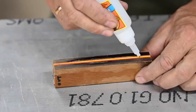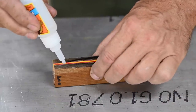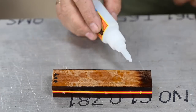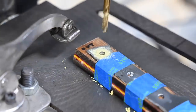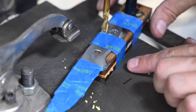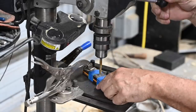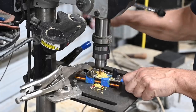So now the blade itself is in good shape and the main thing left is to make the handle. First we'll drill the pin holes. Joey starts this process by joining the faces of the scales together with a couple dabs of CA glue, then it's over to the drill press. Using the knife as a guide he drills a hole on one end, inserts a locator pin, then drills the hole at the far end. By adding a locator pin in that hole, the center hole can be drilled without any possibility of being jogged out of place. It's absolutely critical that these all line up correctly or you won't be able to fit your handle on.